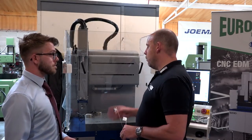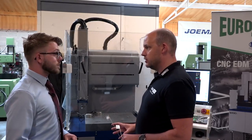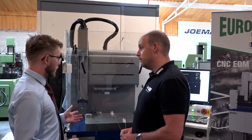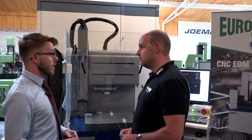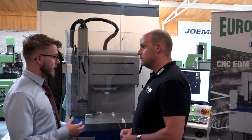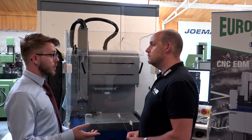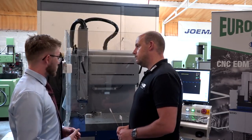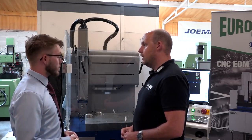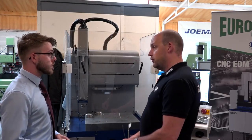Okay, and who would buy these from you then, Ryan? What sort of applications are we looking at? Simply parts that are maybe already finished that just need lots of holes? Yeah, so they pair quite nicely with a wire machine for putting start holes in. If you've got fine work on a wire machine, you can't put a big start hole in. You can use the hole drill to put a small through hole to get your wire threaded. Again, some just general EDM users would use this machine just for putting holes into things. Simple but effective technology. Do they come bigger than the NSD 510 as well?